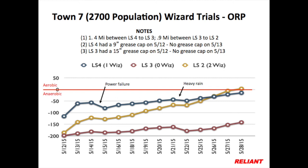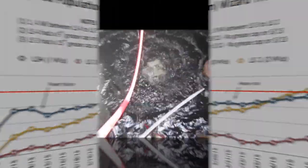Once the microbial population in the wet well becomes aerobic, it is impossible for H2S gas to form, and because aerobes are more aggressive than anaerobes, the microbes passing downstream will build a population in the downstream pipes and assist in further elimination of the corrosive gas.